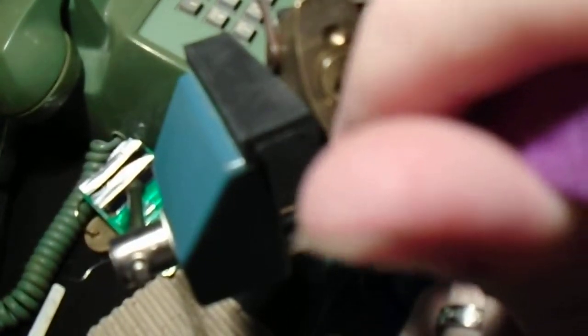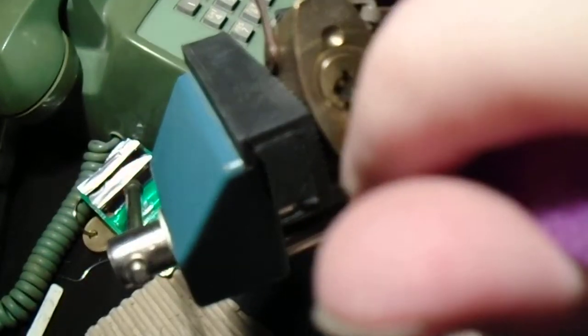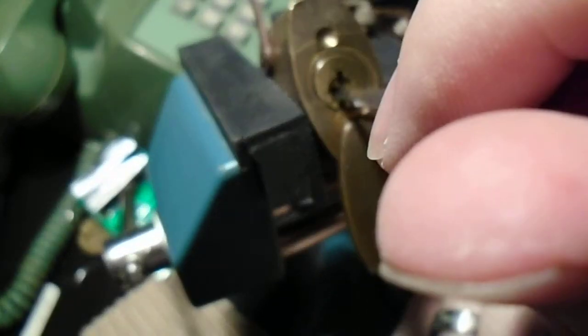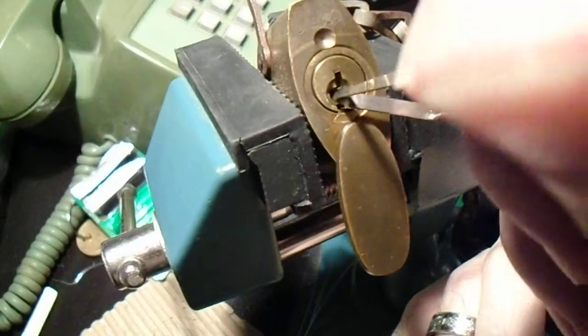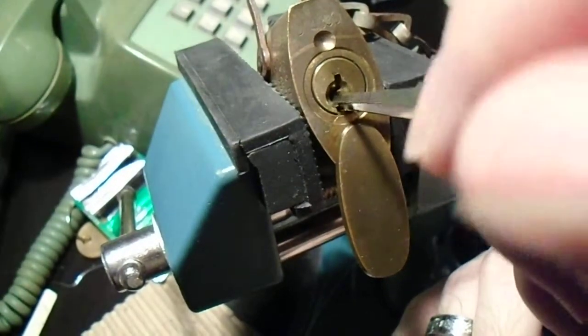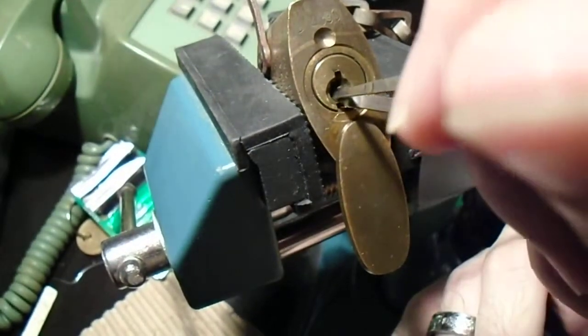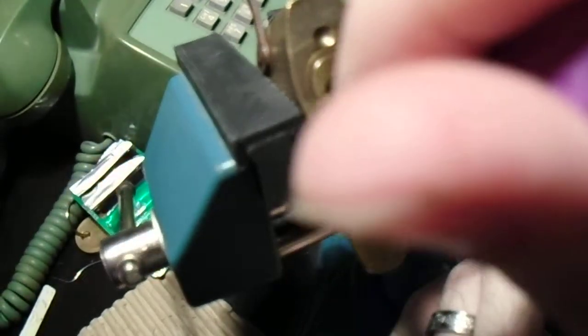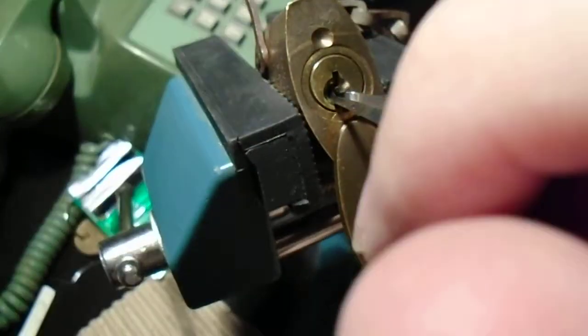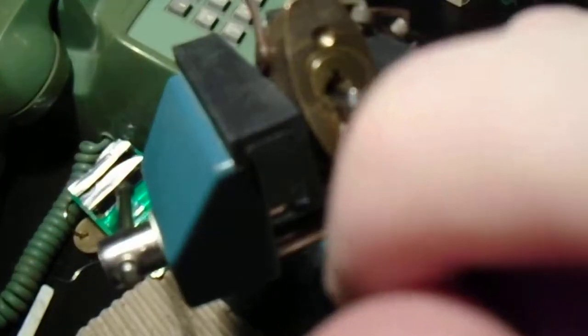We're not getting any clicks that we should be. Now, these are surprisingly tricky. Despite how old they are, they do very definitely have spool pins — although it could always be pins that have corroded into spools over time or something. But we're just going to keep feeling around. This is one of the few cases where you have a lock that acts like it has security pins, but you really don't want a false set. Because when you get a false set, all it's going to do is lock up on you, and then you've got to start all over again. This is just becoming a sort of random game of feeling around, because I'm not getting any clear or consistent binding order on this.